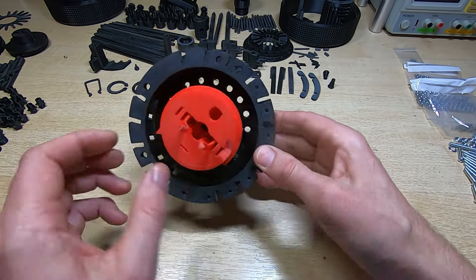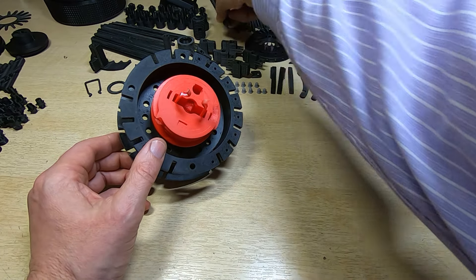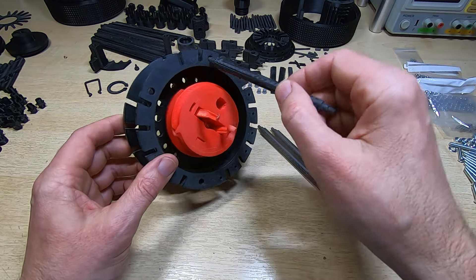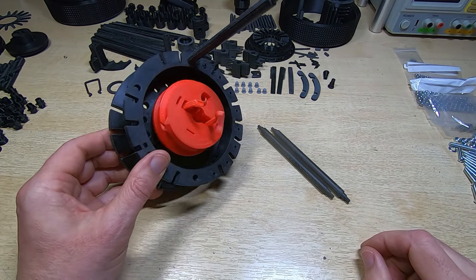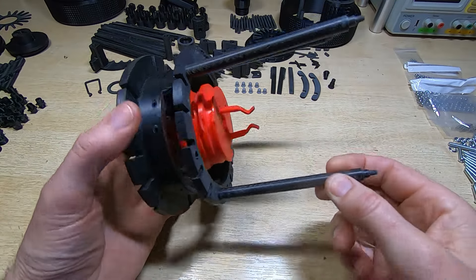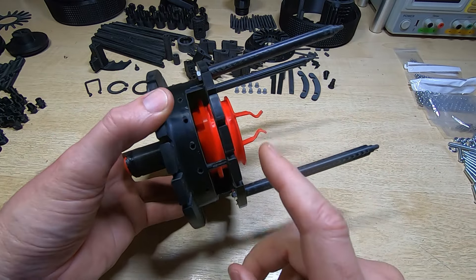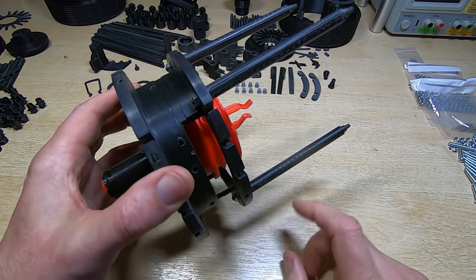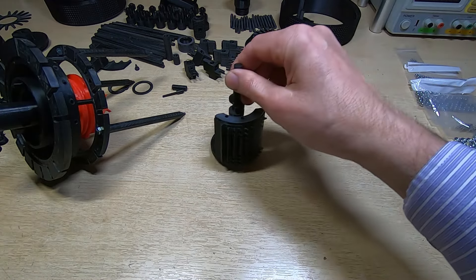The tens bell is fitted — it rotates nicely and freely with about half a millimeter of end float, which is fine. The next step is to fit the three support pillars. I've already cut the threads on the ends of these, they go in here and are secured with an M4 nut. They went together quite nicely — we don't want to over-tighten as it's plastic, but they need to be snug enough so they don't move around.